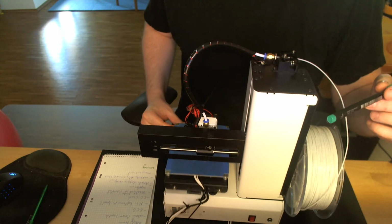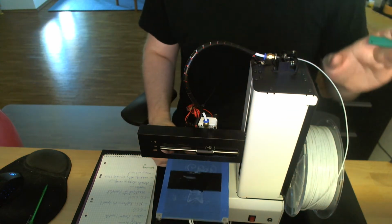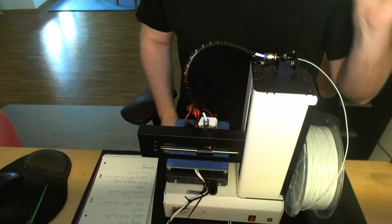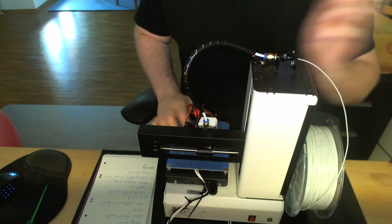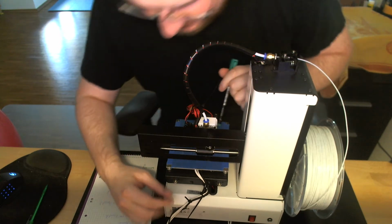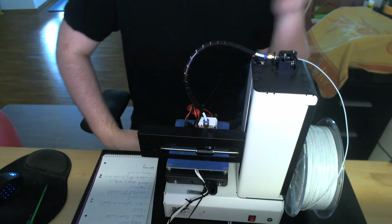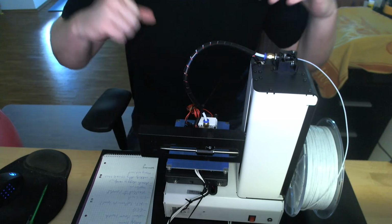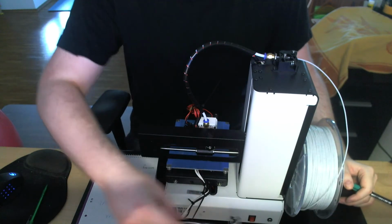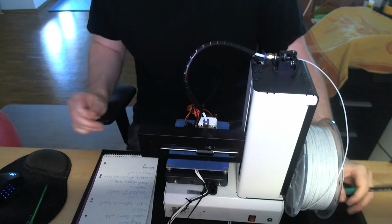while moving, something could tap into the cable, like breaking after 3 hours of printing. Well, that was actually very bad luck for me, but it seems it's a common design flaw that the cable rubs between the drive belt and the coupler, or even gets wrapped around it and simply torn off, broken, or everything. So I had to make this construction from a bigger diameter, and well, yeah, it's not super fancy or something to be proud of.